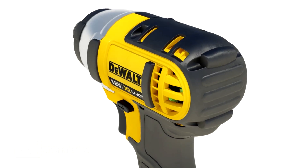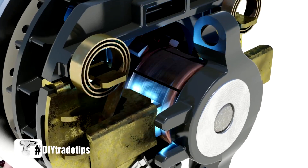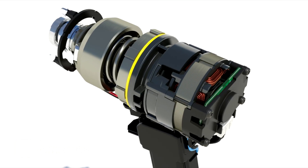This is the rotor there. When you have brushes on the motor, it's creating friction, it's creating heat, sparks, and that's all forms of energy loss. So by not having any brushes, you're not losing any energy whatsoever.